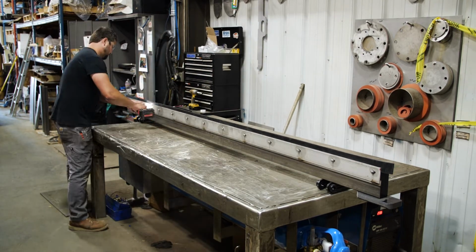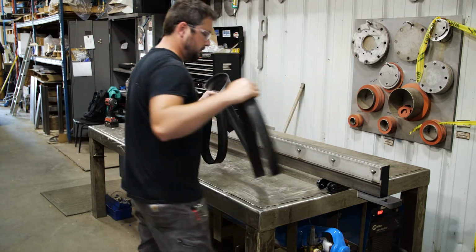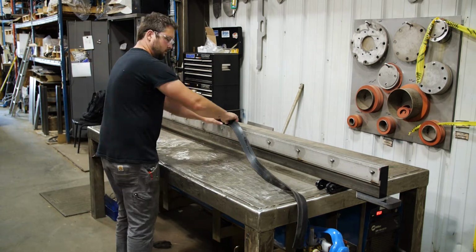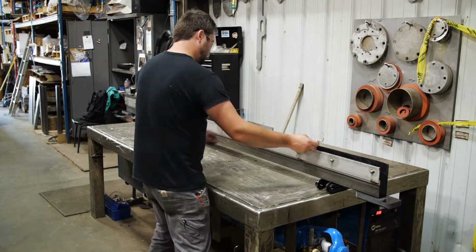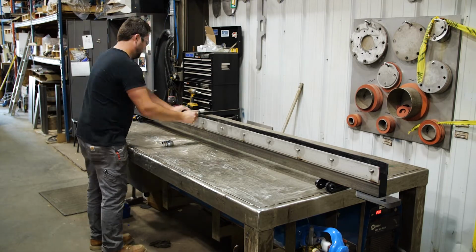Replacement of the strips is done by loosening all the nuts that hold the stainless retaining bracket to the flight skimmer. Once loose, remove the old strip and replace it by inserting a new strip so that it overhangs each end and edge by approximately 1 inch. Tighten all the bolts. Repeat for all flight skimmers.